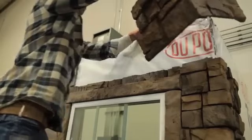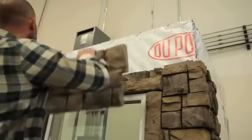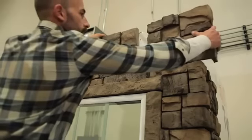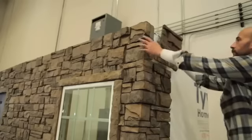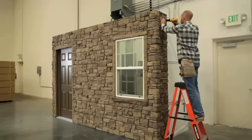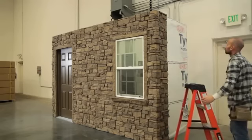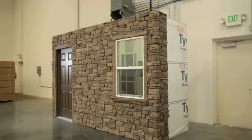Now that we know the remaining space left for a partial panel, this partial panel can be pre-made for each remaining row. So on the next row, use the partial panel on a different section of the row, maybe as the first piece. This will stagger the panels, varying the panel edges for the most authentic installation. On the second and subsequent rows, wait to install the corner on the right side until the last panel can be secured. Proceed up the wall in the same manner to ensure a natural look.